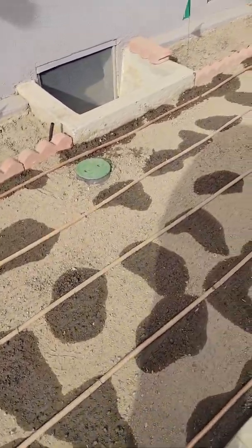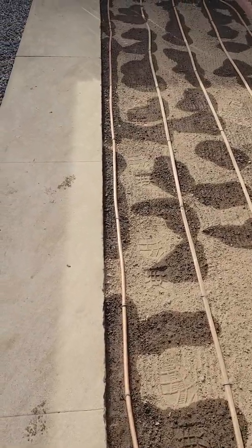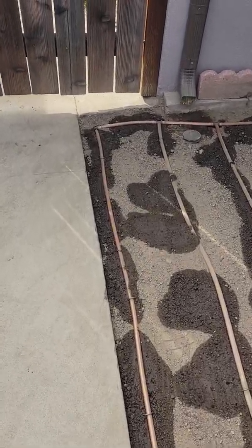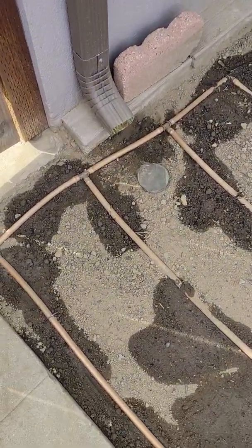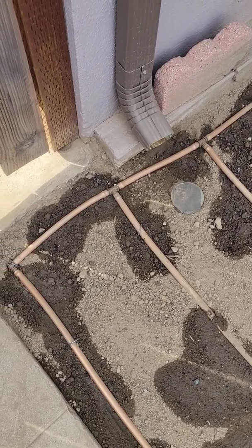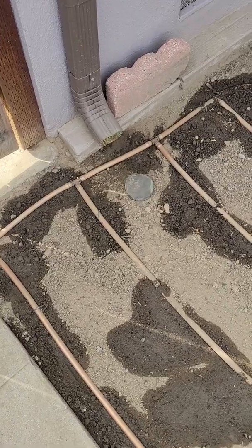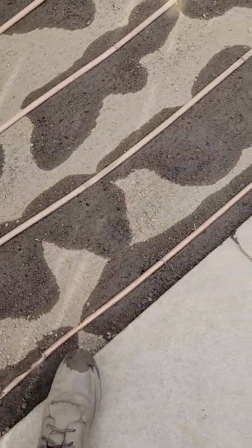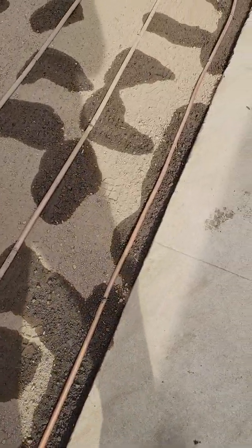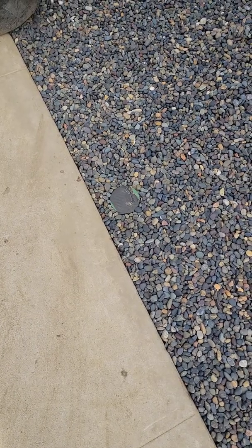We have these pop-up emitters, and we have a multi-flow drainage system running down the side of the sidewalk coming up to where this drain is right here — this rain gutter. I'm going to put a little bit bigger grate on top of that so we can catch that water, or I might run a pipe down into there. They have an outlet pipe that we can situate to go right down into that drain, and that drain traverses over into a vertical drain called a multi-flow. The concept is to have that water pop up over here and traverse over the sidewalk into this drain.